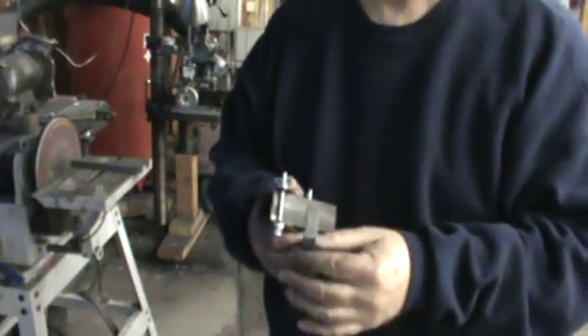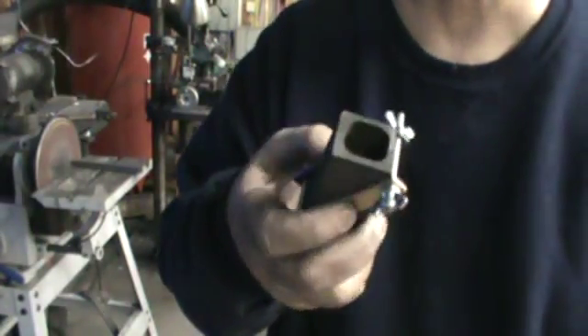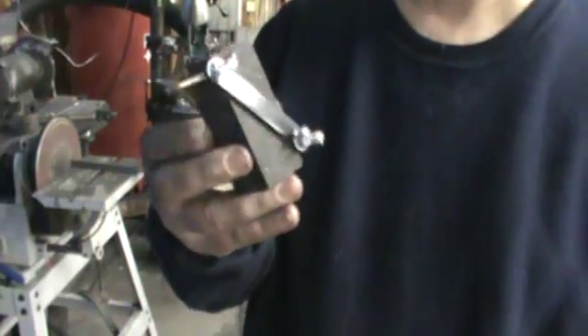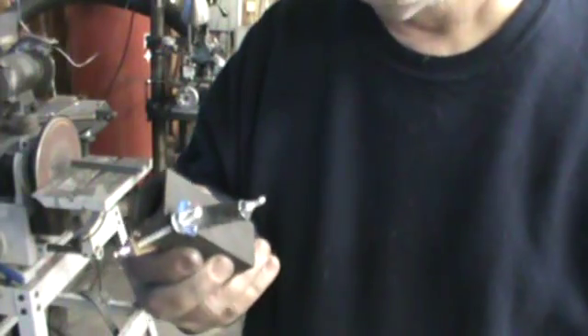I've got the little clamp that I make that holds the molds together. The first test I just used baling wire, but these are the clamps I provide with the gravity mold. I put it diagonal — gives me more clamping surface. The thing you have to remember is that steel expands. The screws are going to expand, the bars are going to expand, and it's going to expand at a greater rate than the graphite. So the clamp is going to get a little bit loose.